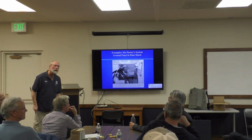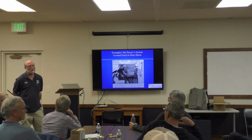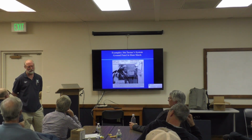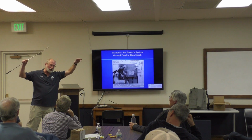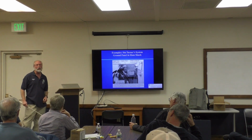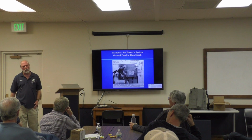Mike? You're talking about going through the wood, like the plywood where you nail your shingles on? Yeah. What if you have a metal roof? Does that affect it in any way? I'm thinking that the NEC requires metal roofs. A metal roof is a metal structure sticking up into the air, and the NEC says all metal structures sticking up in the air need to be grounded. So I'm going to guess, I don't know this for sure because I've never had a metal roof, that a metal roof has an NEC requirement to be pretty well grounded.